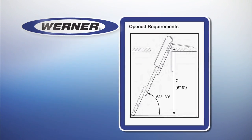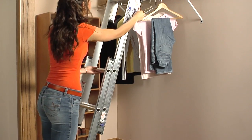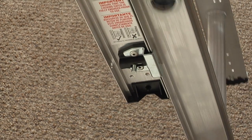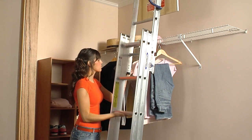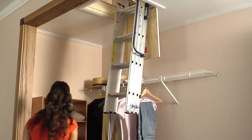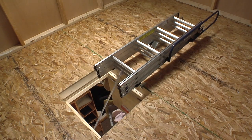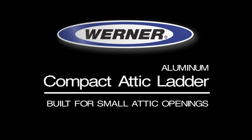Check the ladder angle against the safety label. To properly stow the ladder, retract both right-hand side catches C and D and rotate both catch levers upward into the open position. Retract catch A, then slide the front frame fully upwards until the catch engages again. Retract catch B and slide the middle ladder frame upwards until the catch re-engages. Release both right-hand catches C and D and ensure both are fully engaged. Place the plastic stowing hook over and at the center of the rear ladder section bottom rung, push the ladder vertically upward and fully into the attic hole. Use the assist pole to raise the door and turn the latch to close. Now you're ready to use the Werner Compact Attic Ladder and turn attic space into usable space.